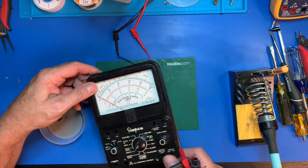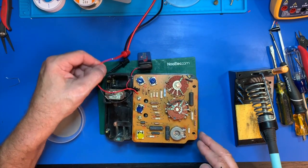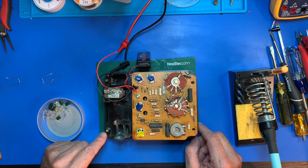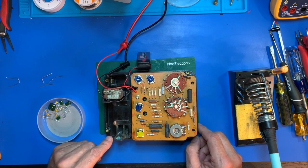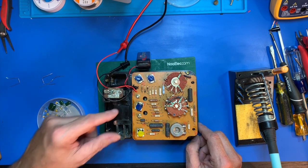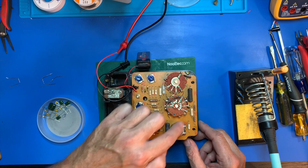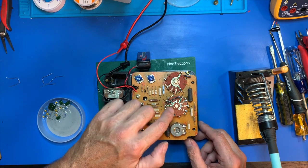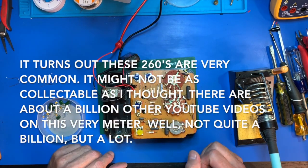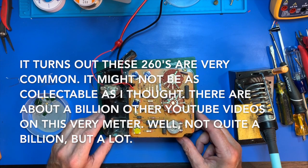That's okay. At this point I'm going to get some new fuses, figure out how to connect the 1.5 volts properly and come up with some type of metal spring brackets. We'll clean up the connectors really well using some contact cleaner, and glue this standoff post back in. I think at least as an ohmmeter we're going to have something pretty good here, and I think we can get it going on AC as well.